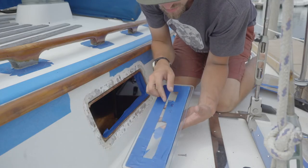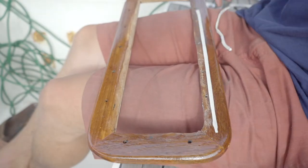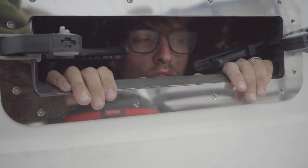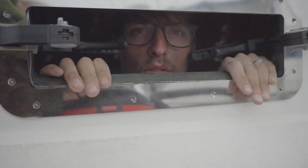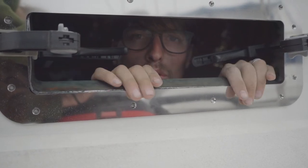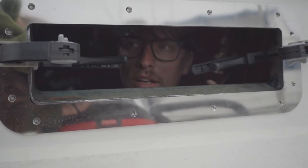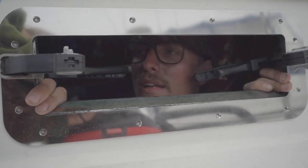The final step in this process was to reinstall our port lights. All of the non-opening port lights got brand new glass, and all of the opening port lights were already in pretty good shape, so I just buffed them all out, cleaned them up, re-varnished the teak trim, and re-installed everything using Butyl and Sikaflex. We are just dry fitting our port lights — it takes a little bit of convincing because this is all new. The holes are not drilled right now. I put it on the inside, put two clamps on, got the outside roughly where I want it, and then I'll fine tune it, drill them all, and come back and seal it up.